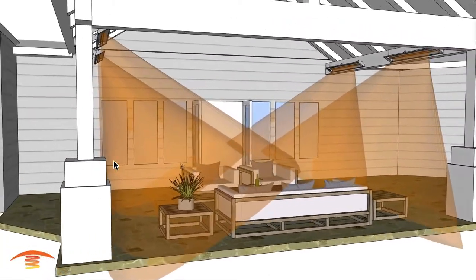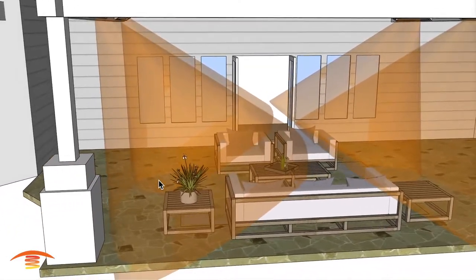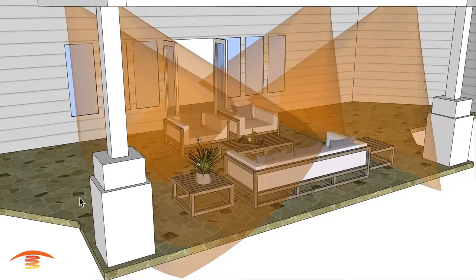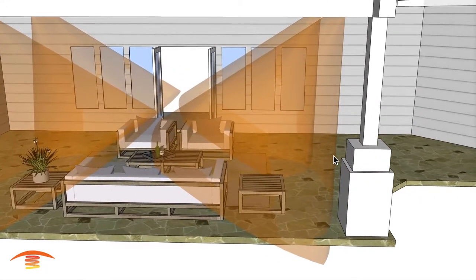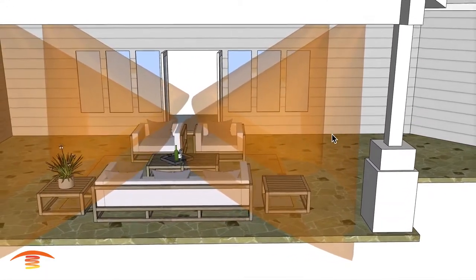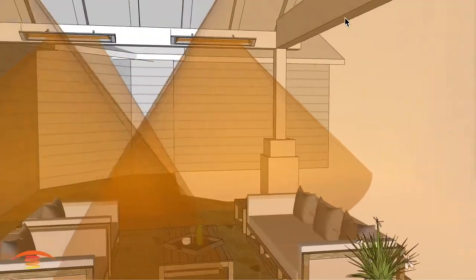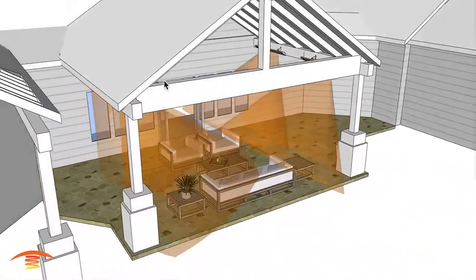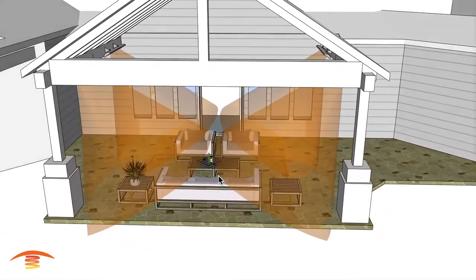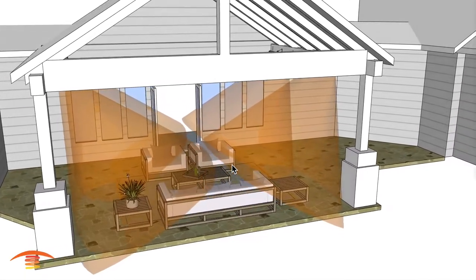But it's still not the ideal amount of heat for this whole entire space. I have these at 30-degree angles from out, or you can go out 6 degrees down, and we're capturing pretty much the whole space. I'm missing about a foot here all the way down, a foot here all the way down, so that will reduce some of the demand. So instead of 5.5, maybe you just need five units total, and maybe you could put one on this back beam over here if you wanted to go with all electric and still ensure adequate heat.